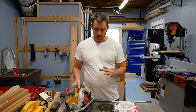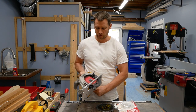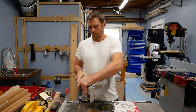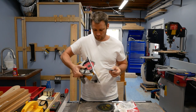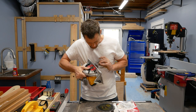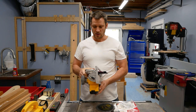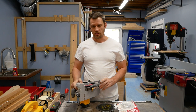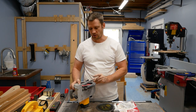The thing about this is that you're going to lose some clearance, but I can show you here — the actual clearance is probably about one and three quarter inches, which is plenty for most hardy plank cutting. The siding pieces are about a quarter inch thick, so this blade is just fine for that. And if you have some trim pieces made out of hardy plank, those are about three quarter inches, so this clearance should be more than enough for anything you need.